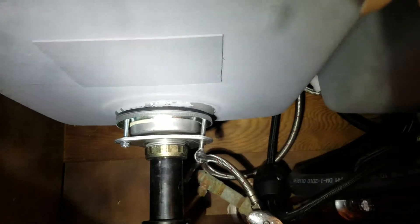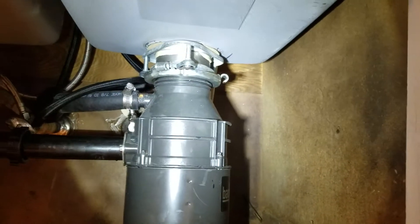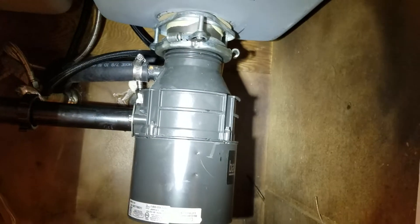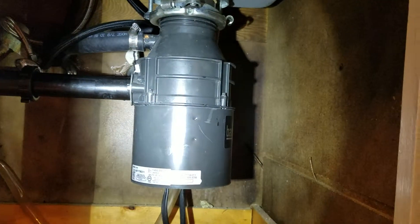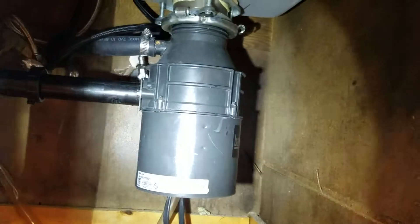Do monitor this area any time you have plumbing work done in the home, or even with existing plumbing — take a trip through occasionally and make sure you're not getting any moisture. Even if it just beads up and drops off occasionally, you need to get after it right away because it will develop into something that's going to cause damage.